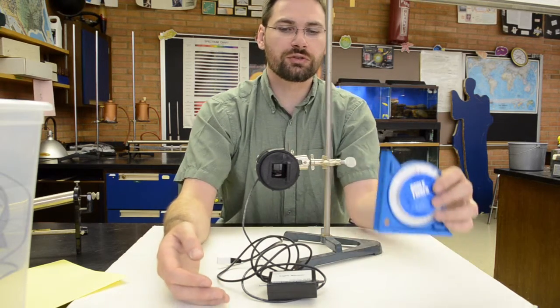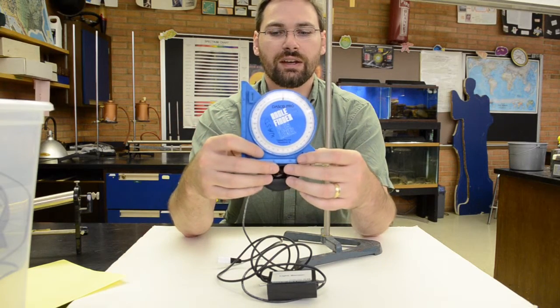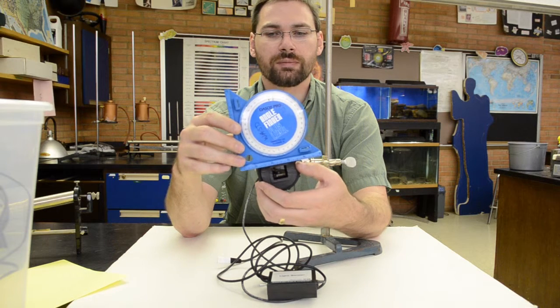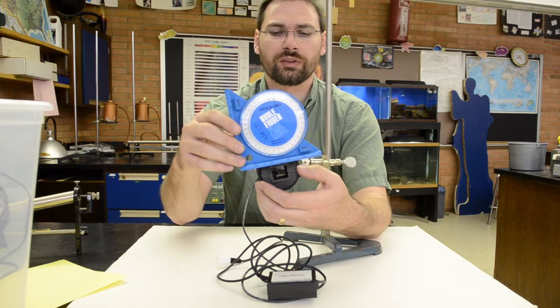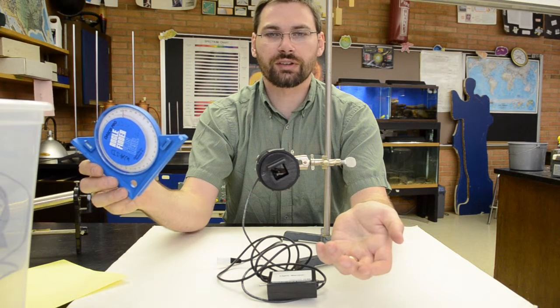So what the angle finder is used for is like this. You start out with a polarizer at some position, and you can call this a reference angle of 0, and then if you want to increment by 5 degrees, you can just turn the cap until the angle finder reads whatever angle you're looking for by 5 degree or 10 degree increments, and you just continue to turn the cap, each time removing the angle finder until you get the angle you're looking for.